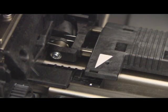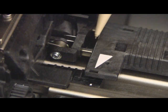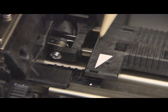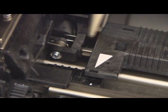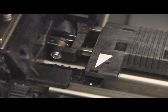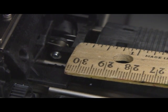We are going to look at how to calibrate, or rather set, the sensors on the CLS 621 printer. Inside the CLS 621 printer, there's something very important to set properly. There needs to be at least a quarter-inch gap between this part of the sensor or guide and this space — about a quarter of an inch, like so. You can kind of see it; I have it on an angle in the video.